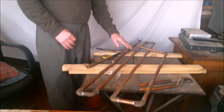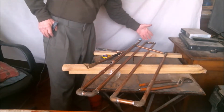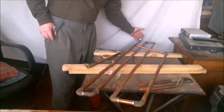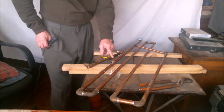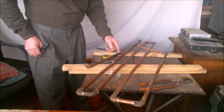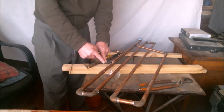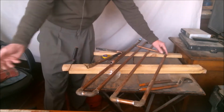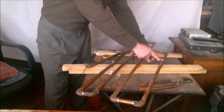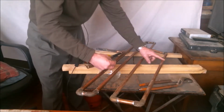But what happens if the main stop valve of the house is the only cutoff valve for this section, and it fails, producing a non-stop dripping? While we work here, water keeps seeping in, drop by drop, throughout the piping, and comes out here, drop by drop. We can put our little tube in there, take all the water out, and hope we have enough time to prepare the surfaces, put on the flux, and solder before the water reaches heat and starts vaporizing and spluttering.